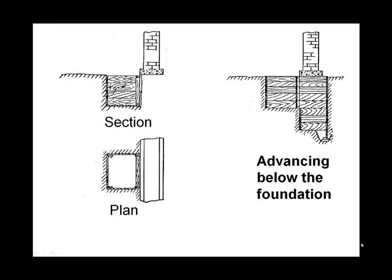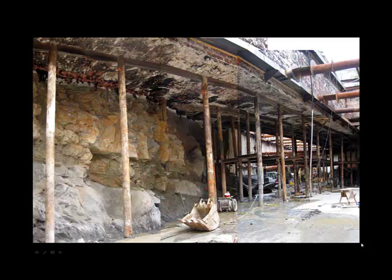You might remember this slide from cut and cover tunnels. It shows the existing subway tunnel being supported on drilled-in piles, and I also pointed out the rock face produced under that existing structure. Parts of this job have rock — very high rock right up to the existing structure. But parts of this project have earth underlying the existing tunnel. So if this was earth and not rock, how do you support it as you try to excavate below the existing tunnel?